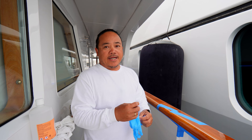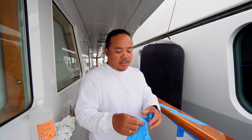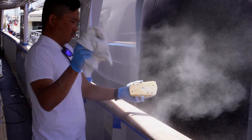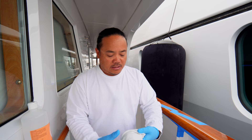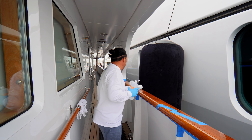Good morning guys, welcome to the video. This one has been sanded yesterday with 320-grit sandpaper. Before you start burnishing, first things first, you have to clean it. Get yourself good gloves - wear your gloves because you don't want oily hands on a freshly sanded capping rail because the varnish doesn't stick into oily spots. Get yourself a nice clean cotton rag and then alcohol - give it a wipe with your alcohol.